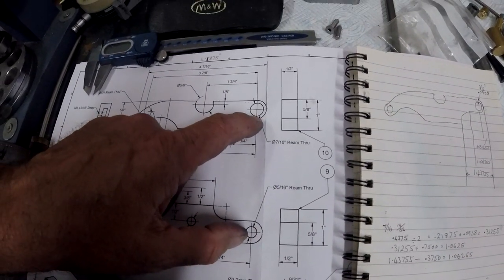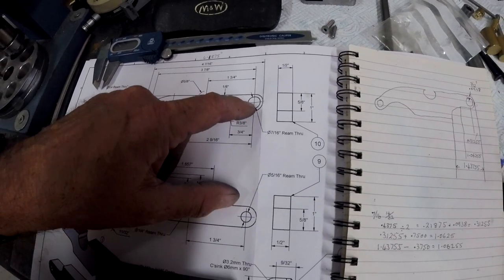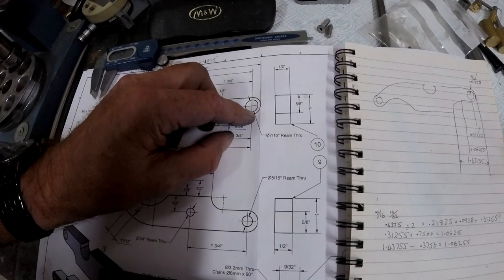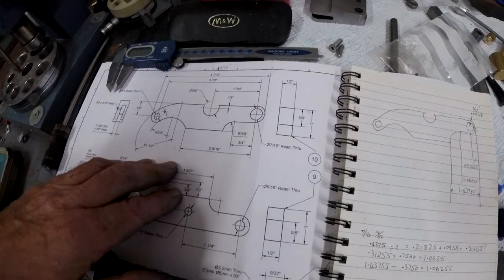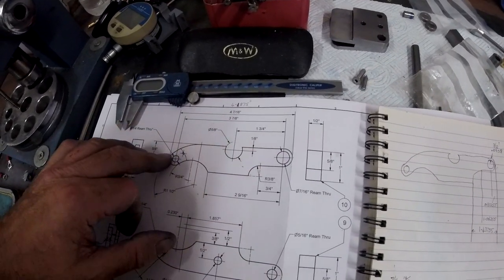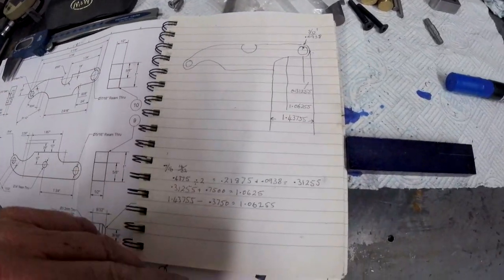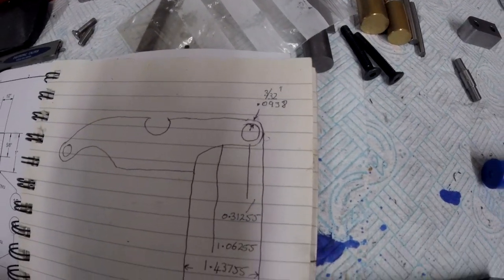And I know that the gap all the way round is equal. So basing on that, I've measured half of that, and the distance between that is 5/8, and I've removed that out of it, and what we're left, I've divided by 2, and that gave me some measurements from the edge of the material. Now, personally, if I were doing a CAD drawing, I would always mark from the edge to every dimension. But they're not. They're just giving you 2 here, and then everything from it, but not to it, from the edge. So, some great calculations I've been doing. And that's what I've come up with.